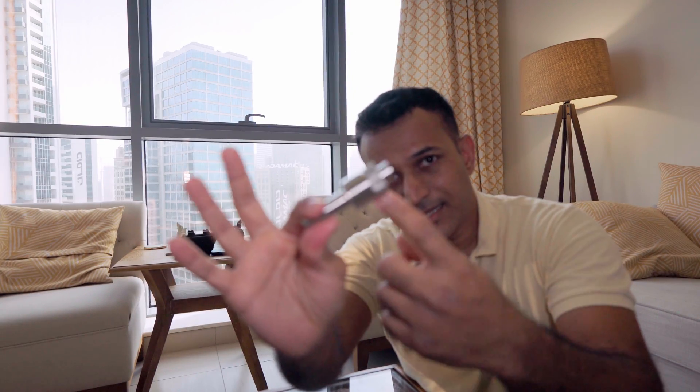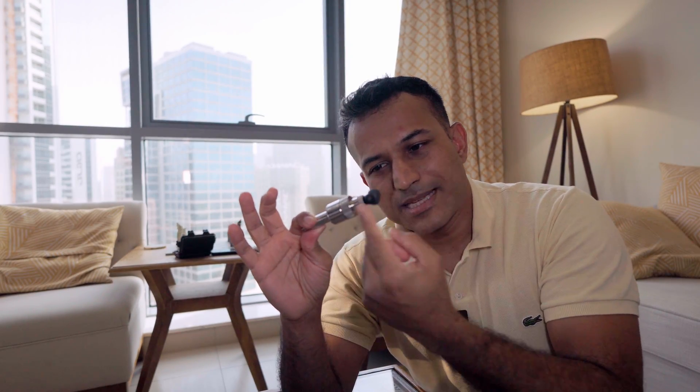But that's not all. This is a living room - not a controlled environment, not a studio, certainly not an anechoic chamber, which you can probably tell from my voice. There are resonances, reflections off the window, modes - lots of things that interfere with the actual measurement process. To make matters worse, this sort of device, this coupler mic, is only meant to measure things that create sound right over in what is basically an artificial ear canal. And that's a problem.